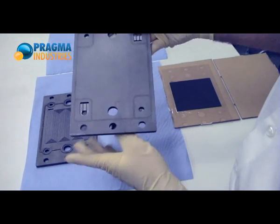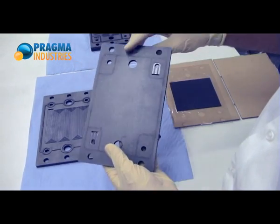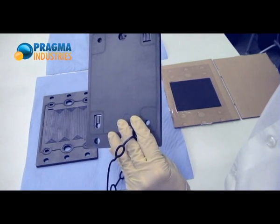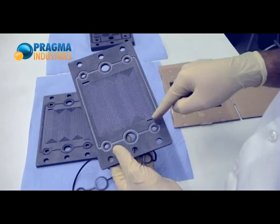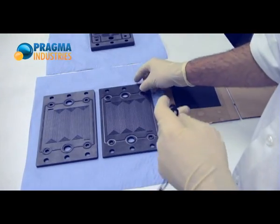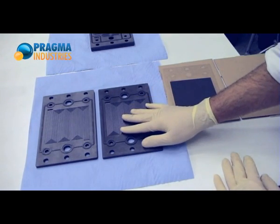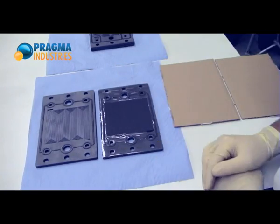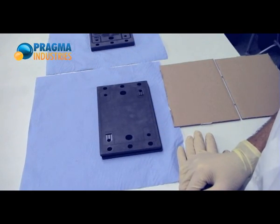If I return the plate, you can see that this hole is connected through the plate to this gas channel here. So the gas flowing here will go there, flow through the flow field, exit here, and go into this hole. Basically, how it is made is very simple: one plate with distribution channel, one MEA placed here, and in front of this, another plate — and you have, like this, one cell.